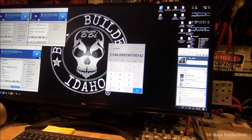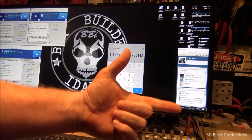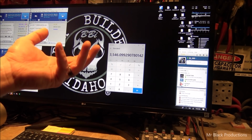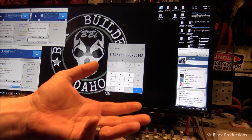So, now Vader, on the other hand, we're talking 12,000 volts, 9.5 amps on the top tap, and that is a continuous duty transformer. But now I've got a bunch of these little guys that are laying around here that I've got for the SP220s. Remember, that's a voltage doubling circuit, and that's an intermediate duty transformer, and they're getting the original ones, which he copied. He just literally copied the original one and gave it an updated core.